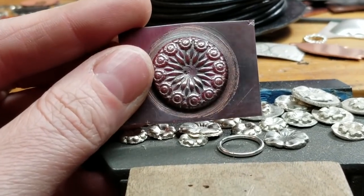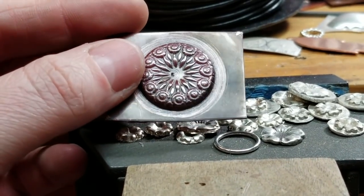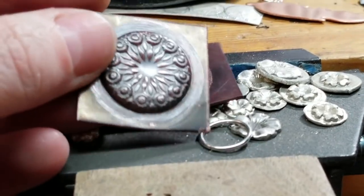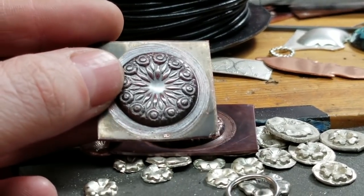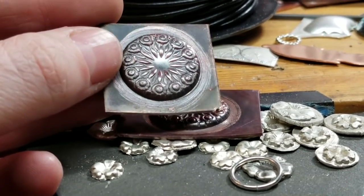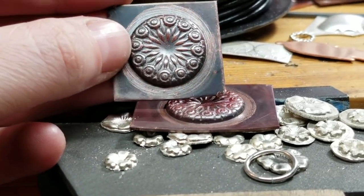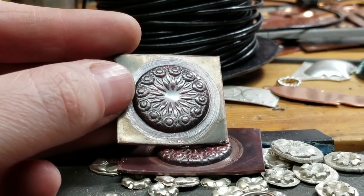Okay, you can see this is the first piece I pressed before cleaning up the die — you can see that big divot created by the burr at the center of the puck, and all those concentric lines. After cleaning it up using the ball burr and the sanding disc, the divots are gone and the concentric circles are gone. It was really simple — if I wasn't filming it probably would have taken maybe two minutes. Now that it's cleaned up, I won't have to do it again since the die will work for hundreds of thousands of pressings. There's quite a big difference for just a little bit of work — thanks for watching.